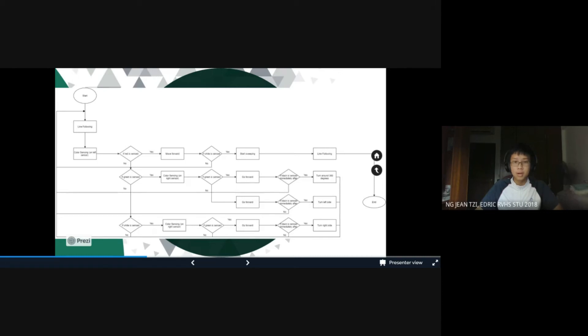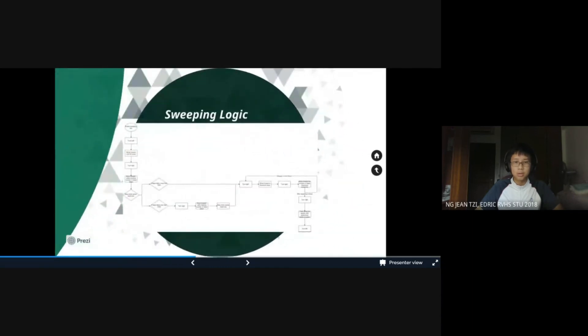However, when we enter the evacuation zone, we have no idea where we are. Therefore, we have to narrow down the possible orientation and location of the robot. First, we make a left turn to proceed to one of the four corners, reducing the number of places the robot can be to four. This also ensures that we know the robot's orientation based on the location. Next, the robot turns right and moves to the other side of the box — measuring the distance travelled will inform us whether the robot is moving along the short side or the long side of the rectangle. If it is on the short side, it makes another right turn and moves forward to the other side of the box, measuring the distance travelled along the way. This ensures the robot is only in two possible locations. Next, the sweeping motion begins. As the robot has a dimension of 15cm by 15cm, it will need to run along the long side four times. After arriving at the other side of the evacuation zone, it moves 15cm to the right to maximise the area covered and minimise the time required, by making a right turn and moving forward 15cm — equivalent to a thousand steps of the motor.